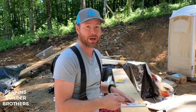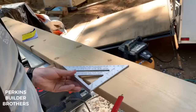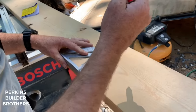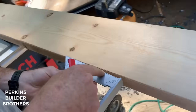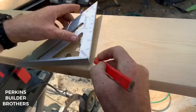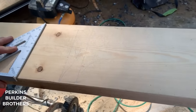So let's start with the things that people do know about a speed square most commonly. Number one: you can hook it on a board, pull it tight, and you can make a perpendicular line to the board, and you can cut it. The second thing that most people already know is that it has a tape measure on it. So say I wanted to mark a stud layout — I would put that on the mark, mark an inch and a half, draw another line, and there's a stud layout. Boom.